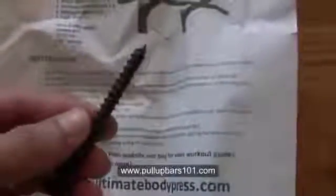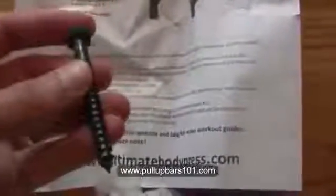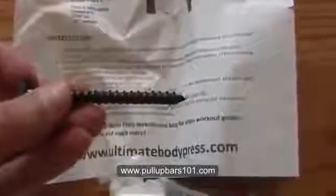If you look at the instruction sheet, you'll see that it says right here to pre-drill your 4 holes using a 7/16 inch bit, which is nearly a 1/2 inch diameter. If you were to follow the directions and do that, I think you would find yourself in a mess, because the diameter of the lag bolt itself is smaller than the hole they're telling you to drill. I measured this with some calipers, and I'm actually going to drill with a 7/32 bit when I install it. So now I'm going to get to it. I'll get this installed and we'll do a quick review.